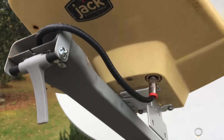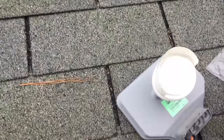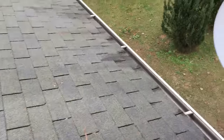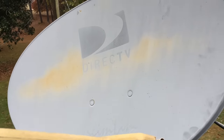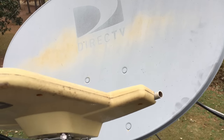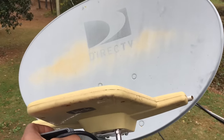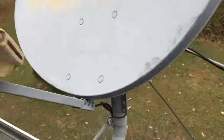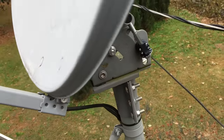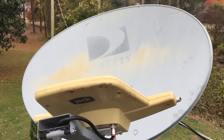Final product mounted - bracket here, cable here. I'll save the old piece just in case I want DirecTV again. I'm actually wondering if the dish will help the signal. Find the best spot, turn it, go down and check your channels. I loosened it just enough where I can turn it but it won't move with the wind. Hope it works out for you - thanks for watching!